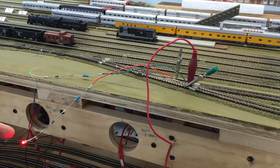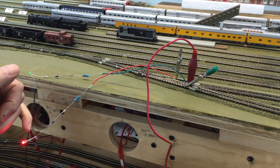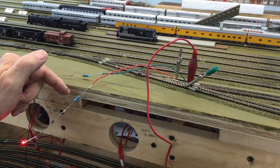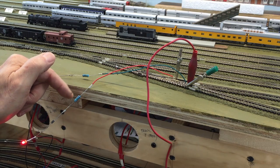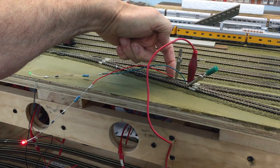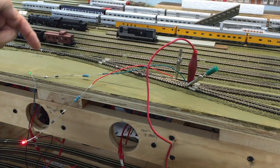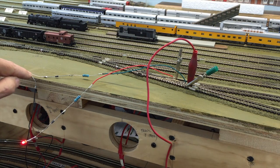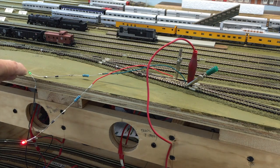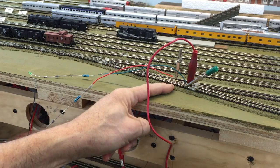I think these are three millimeter LEDs. Got a diode with the band part, which I think is the negative, pointing towards the LED. And then there's a 1500 ohm half-watt resistor — it's the one I use normally for LEDs. And then that's connected over to this track past the wing rail here. The green LED is hooked up to the diode again, with the negative facing towards the LED, another resistor, and hooked up to the other track.